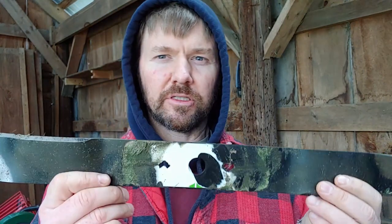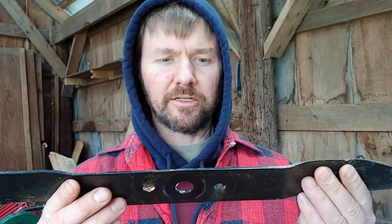If you go to my Facebook, which is the American Edge, I plan on putting up a picture or two of my own mower blades just to illustrate when it's time to replace them. Because you can sharpen them several times depending on their quality, but they don't last forever. The other thing is they almost always need to get cleaned up — I'll show you how to do that.